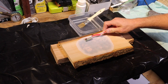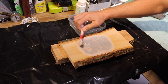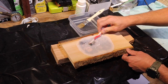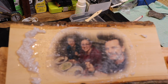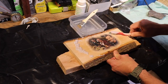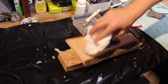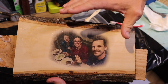At this point the paper may start to flake apart on you. You can switch over to a more aggressive brush and start trying to get the paper to come off. You don't want to go too crazy with it because you don't want to start removing the picture itself — just slowly work away at the paper. The key here is going nice and slow and using a lot of water. If you go too aggressively, you'll start actually taking the image off the wood, and you don't want that.